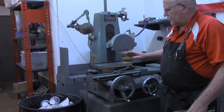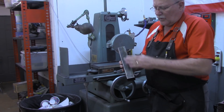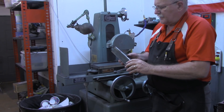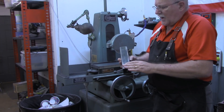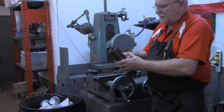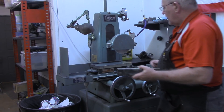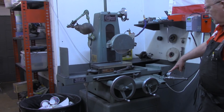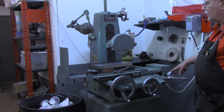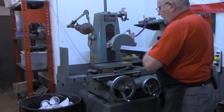I was kind of joking a little bit and said I was going to surface grind this just because I could. I really do want a flat surface for it to set on. There's some mill scale in here and there is some old paint on there — this was used before on another project. So I'm going to start out first milling what's going to be the bottom that will set in the vise. Then we'll turn it over and do the side that the rotary table will actually set on. With my power feed for the x-axis, I wanted a project where I was going full stroke. And this being 10 inches, I'm going to go ahead and go the full stroke length.